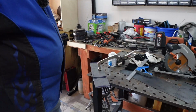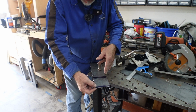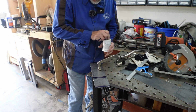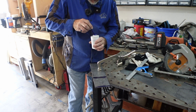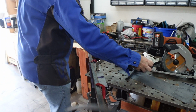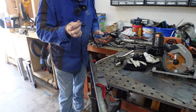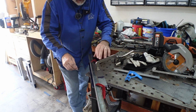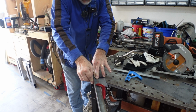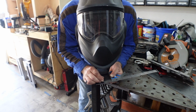Works really well. Okay, so I decided to take 3 inches from the back out. So that's gonna work for me. I'm gonna get this blued up so I know where my line needs to go. Okay, so I have this clamped with C-clamps on each end on my 3-inch mark, so I can scribe this mark down through here. 1 3/8. 1 3/8 in.